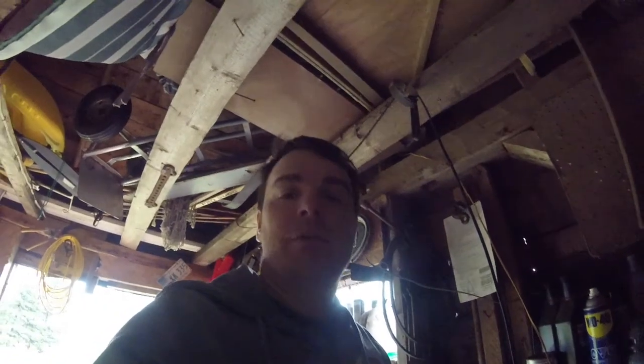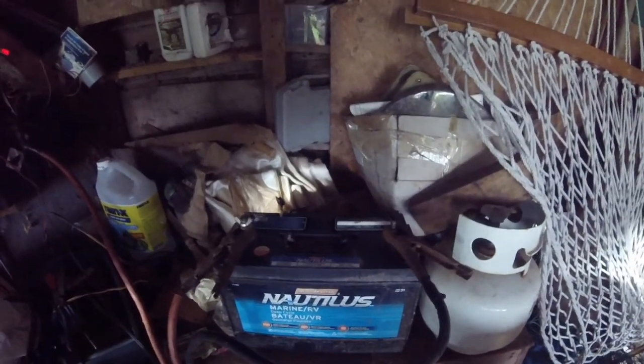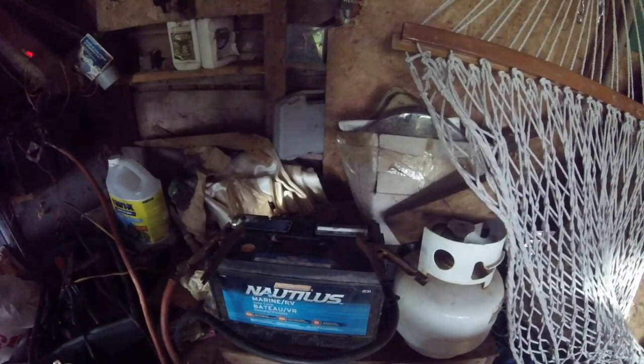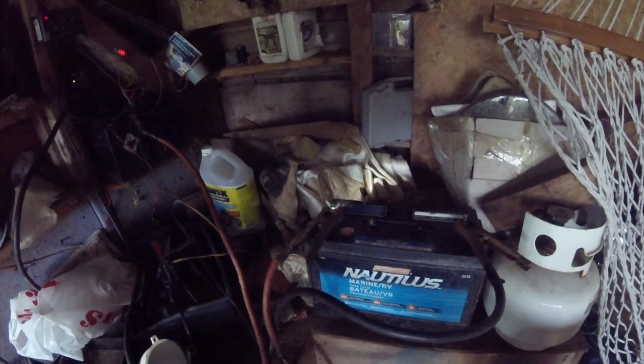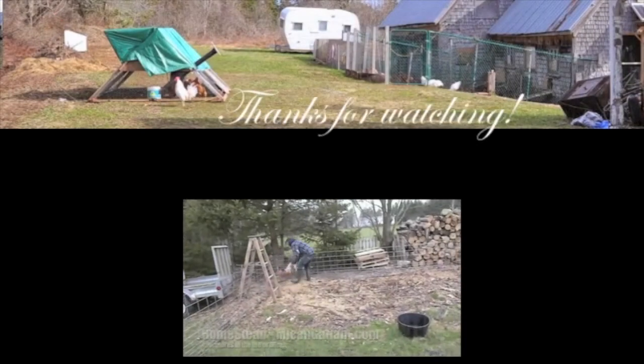So that was my fault. I should have paid attention to the water levels, because that is not a sealed battery, and you need to maintain that liquid in there. So this means this gets an extra life, and maybe that's why it was decreasing in voltage that whole time, and I didn't realize it. So it gets renewed life. I probably should have put some proper distilled water in there, but it's good enough for now. I'll probably have to top it up because it does boil off when it recharges. As it's been recharging, it's probably been a good 24 or 48 hours of charging, and it looks to be back up to power.